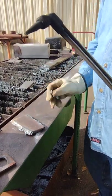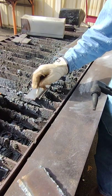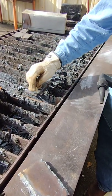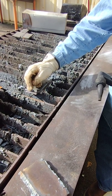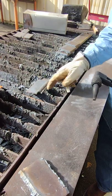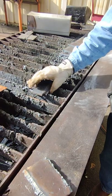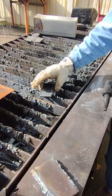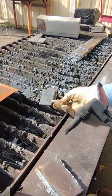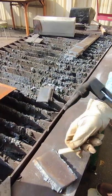Now, I'm going to wash out this lap joint. I'm gonna wash this weld out, but that's not what I'm gonna do first. Actually, I'll probably start down there and wash along the edge right here until I get through this plate and hit that bottom plate and see that separation. Once I see that separation, I can then kind of flick it up and wash out my weld if I've got this flame right.